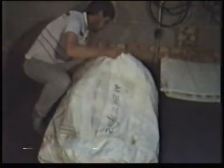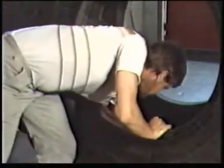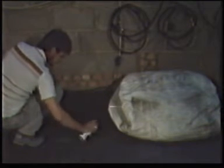When storing cylinder bags, they should be slightly inflated with ends folded in. The ends should also be in the folded position during installation. Never remove or lift heat pads by the power cables, and always treat the heat pads with mold release agent before use. Other points on the heat pads: never leave them on the floor when not in use, and always use them with hand holes running from bead to bead. The cylinder bag should never come in direct contact with a heat pad and must always be used in conjunction with an inside flat airbag.